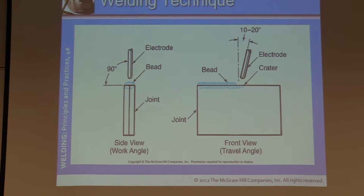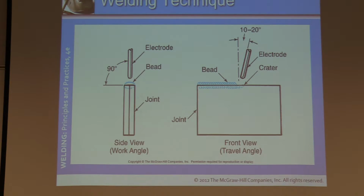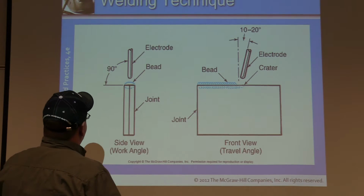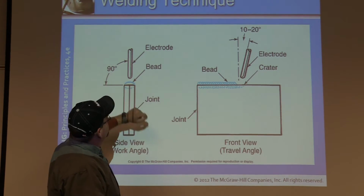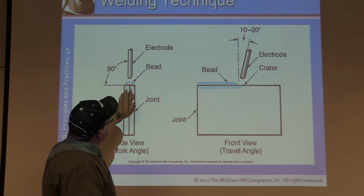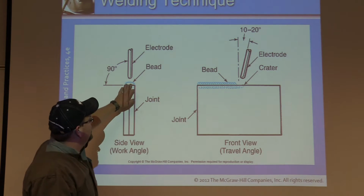Keep continuing on. So when it comes to actually doing the welds, we're going to follow the check-off sheet assigned to your course. Those will be the welds that you're doing. Again, we are teaching to the harder thing. So not necessarily starting out on an edge joint, but stacking beads. We're going to do fillet welds. If you can do a fillet weld, you can usually do an edge joint very well.